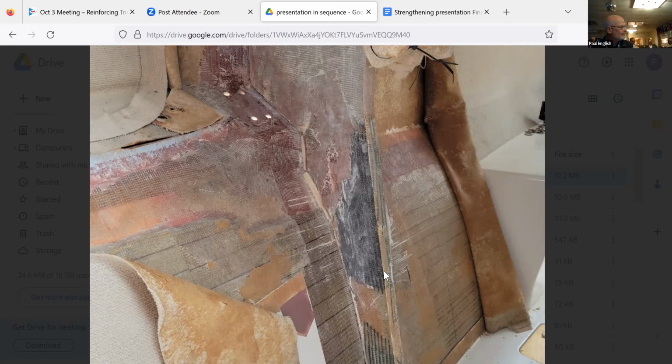So again, when you talk about a design brief, these boats were really set up as cruisers and racers. The first thing you want as a cruiser is access to the V-berth. You want to be able to sleep out there. You don't want to just fill it full of sails. So in the design, they had to make a compromise between access and structural rigidity. The boat would probably be much stronger if there was no access hatch cut out of the right-hand side, which is what we're looking at in this picture. As a result, that starboard side is a little weaker than the port side.